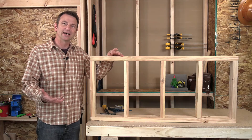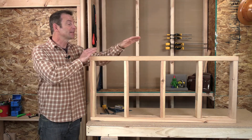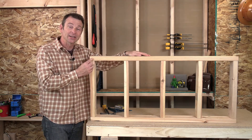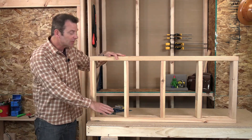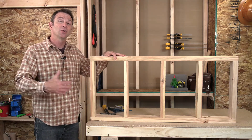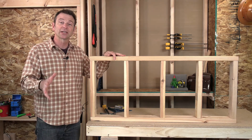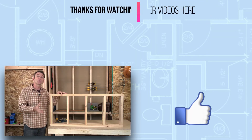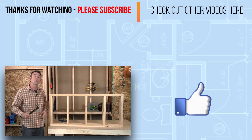Get all of your parts lined up and laid out on the floor, and now you can assemble everything. I recommend taking your top plate and assembling all of your vertical pieces to it exactly where they need to go on your foot marks or on the marks you've made from your plans. Then attach your bottom plate to the bottom ends of all the studs. Use two fasteners per end — you can use three-inch screws with a cordless drill, or a hammer and 16D nails. Either one will work fine.